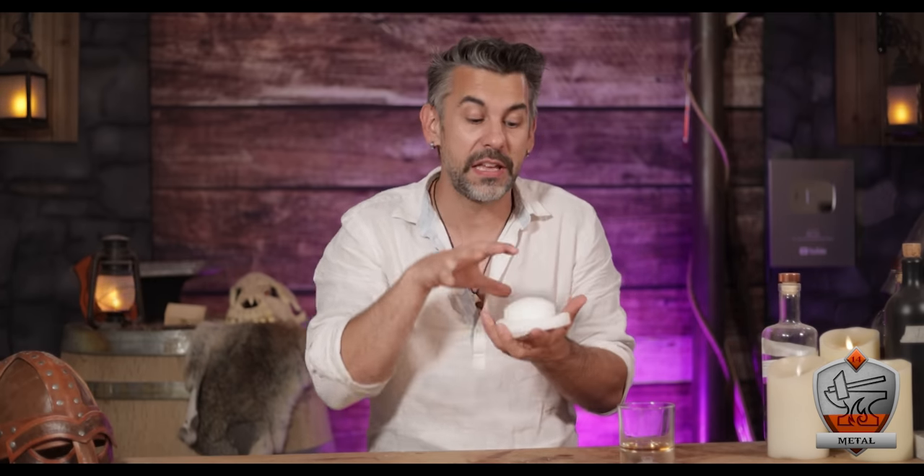To take something from wax and turn it into metal we use something called green sand, or foundry sand. It's super fine and kind of wet and does a really good job taking on the shape of whatever you push into it. I put the wax pieces on a metal plate for a nice flat surface, placed the wooden box around them, and using a strainer pushed the foundry sand through to make sure it was fine and could get into all the details. Once filled, I used the end of a piece of wood to push the sand in — not too hard but enough to surround the whole piece — then used a board to make the bottom nice and flat. Flipped over, everything was solid. The thought is: pour molten metal into the wax, the wax burns away immediately, and the metal takes the exact shape the wax used to be in. That's the theory — we're going to see how this works out.